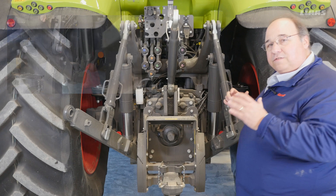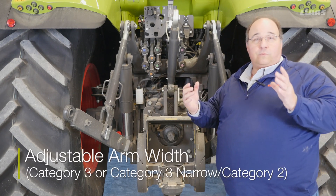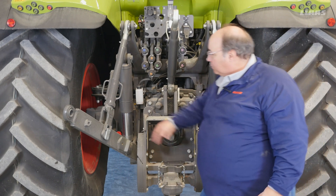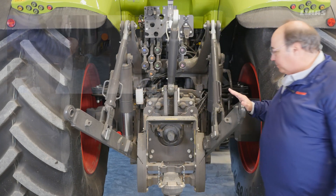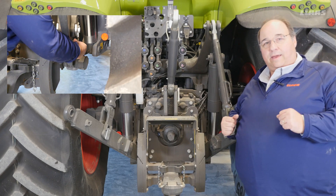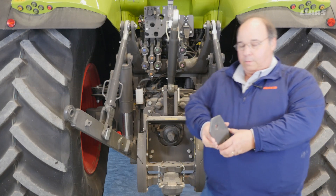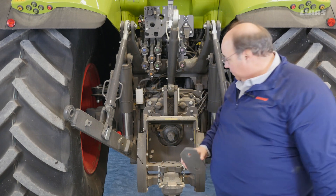This is adjustable from a category 3 to a category 3 narrow, which is also a category 2. The way that it adjusts is through these rub blocks — you can see this side is set up for the wide and this side is set up for the narrow. Simply move these rub blocks around by removing the cap screws and changing them from end to end. We also have some plates or shims that go in between as those blocks wear, and you can easily move these plates or shims around to make up for the difference in wear.